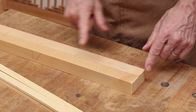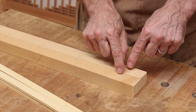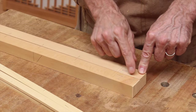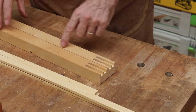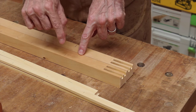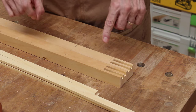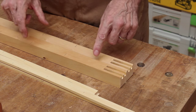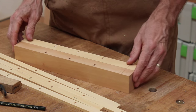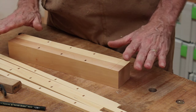That's all the marking for now. The next step is cutting mortises in the stiles. Remember from the exercises, the mortises are 22mm deep, but this time we also have haunches. The mortises are 22mm deep and the haunches are just over 8mm, so make them around about 8.5mm. Once you've cut the mortises, move on to the mortises for the kumiko. These mortises are cut to a depth of at least 7.5mm — no shallower than 7.5mm. You can go to 8mm or 8.5mm; somewhere between 7.5mm and 8.5mm would be fine. Now is also a good time to trim off the ends of the tenons. So at this stage, the rails are done.